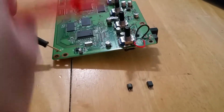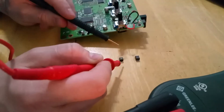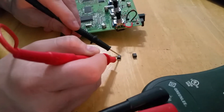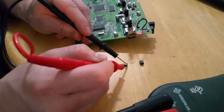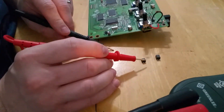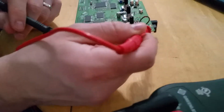In order to test it, the first thing I did was try to check continuity across the legs while it was on the board. I was getting continuity across both legs, but also getting it no matter where I put the probes — and you should only be getting continuity directly across each leg.